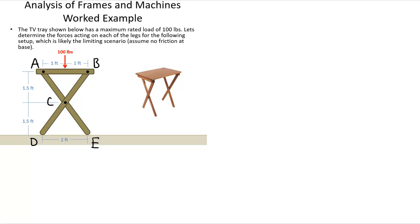I also want to identify a few things. I'm going to look for two-force members, and I'm not going to see any. A–B has a connection point and a pin joint on either side with a force in the middle — that's not a two-force member. A–C–E has a connection point at the top, in the middle, and a force at the base. Same with B–C–D: connection point at top, connection point in the middle, and a force at the base. So no two-force members.